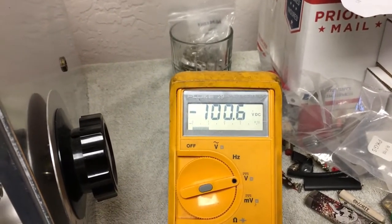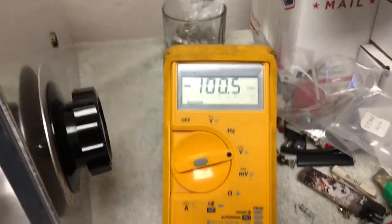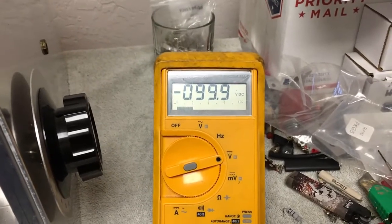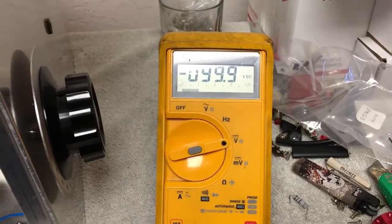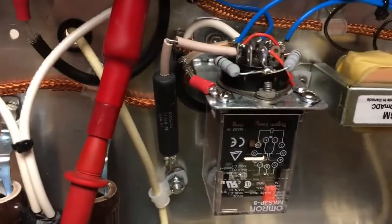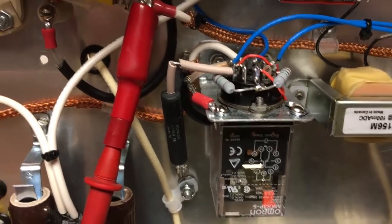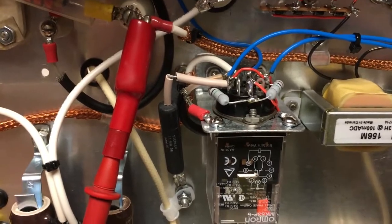It's moving around a little bit. I need to add regulation on the main supply connection to the rheostats, but I need to figure out where the voltage is supposed to be first. It works. I did add the grid leak resistor on the relay — that's an 18K 20-watt job. So that's the grid leak bias for class C AM mode, for AM operation.